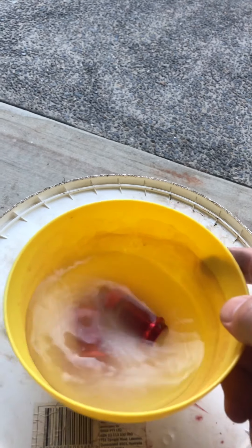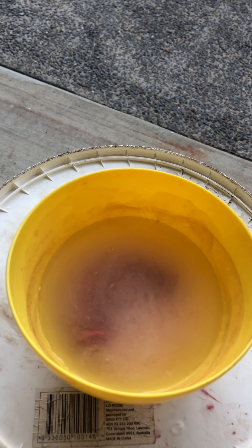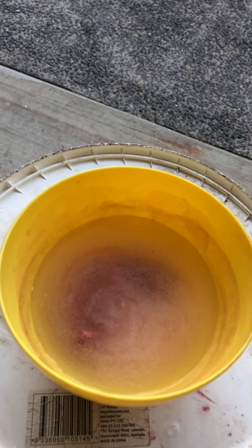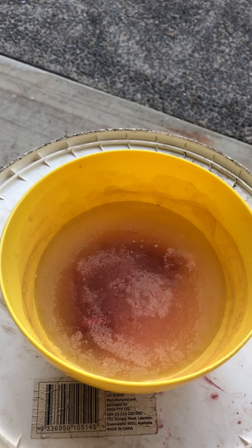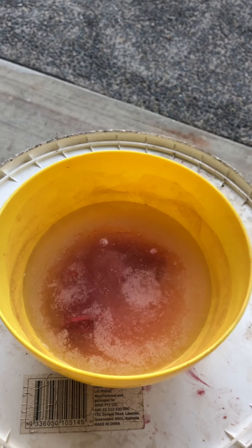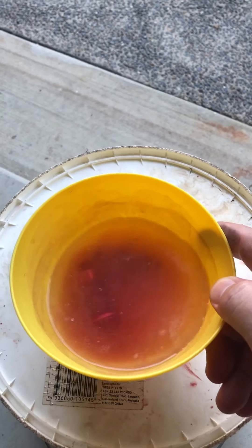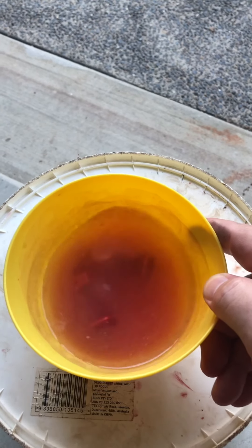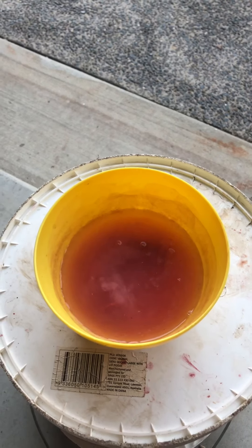The crystals dissolve, and in a minute you'll see it start bubbling. There you go — that's the caustic soda now attacking the anodizing, well the aluminum itself actually. It's etching it, so it's going to remove a layer of the surface. It's going to go in and remove the anodizing and then continue down to remove aluminum if you leave it in there too long — it'll actually start eating the aluminum.